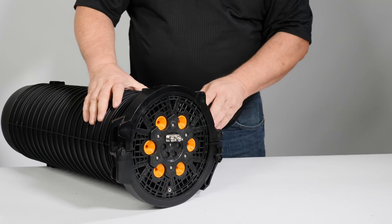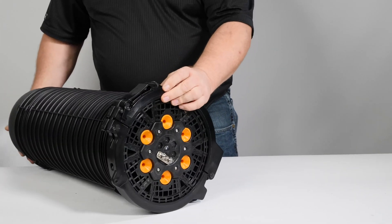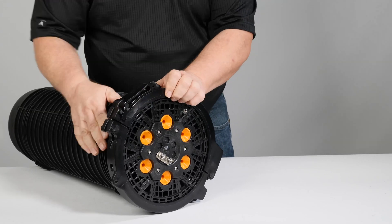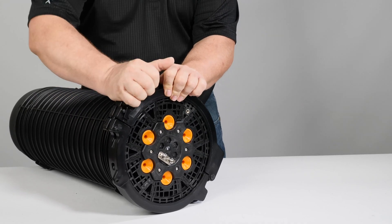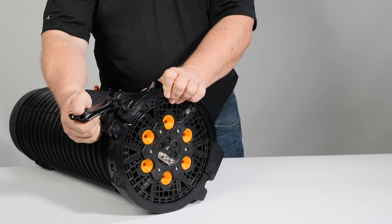This is a two ground stud model. Remove the locking ring by pulling the locking ring handle to disengage the locking tab from the ring. Once disengaged, continue opening the handle to open the locking ring clamp. The locking ring is then expanded and easily removed from the APEX closure.